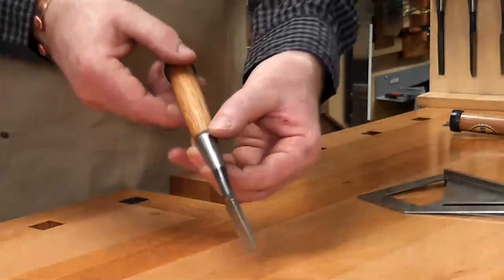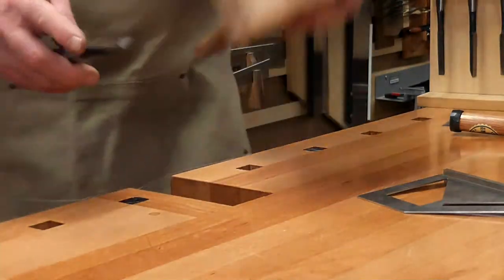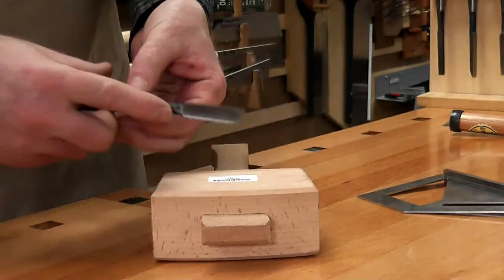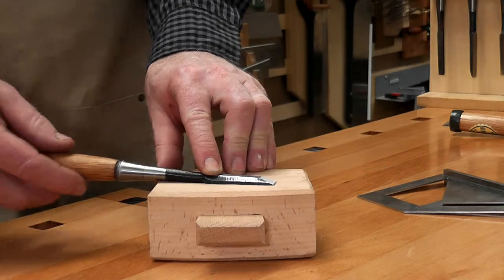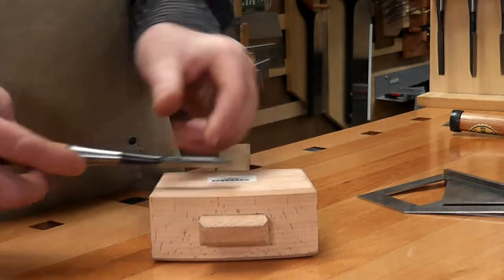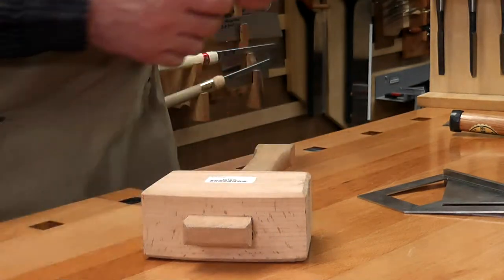I've had people say, if it's not straight, it's bent. No, it's not meant to be straight. It's done for a purpose. It's about giving you clearance to get the chisel further in. From the chisel blank up to the ferrule, that produces quite a straight line, so you can get that in nicely. If the chisel was made dead straight and didn't have this crank bit here, you wouldn't get in far enough. So all those little things make quite a big difference.